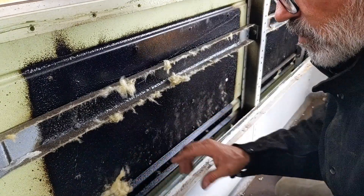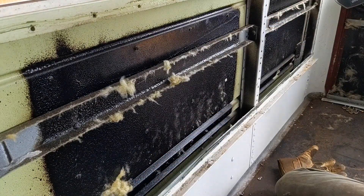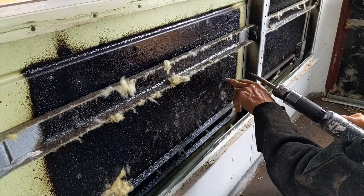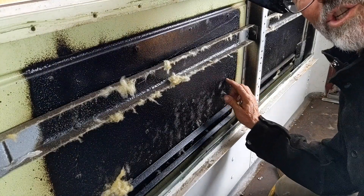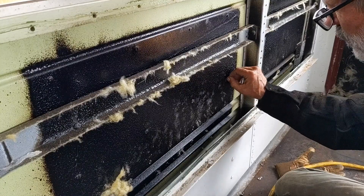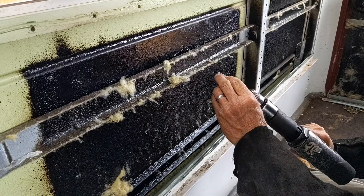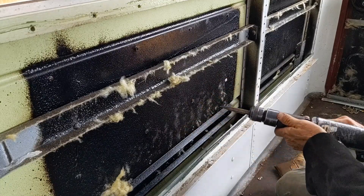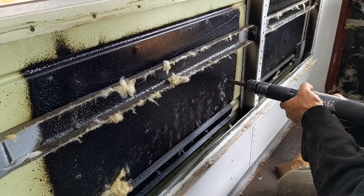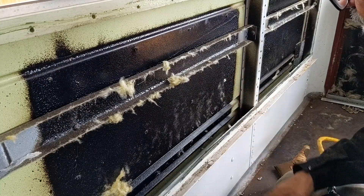Normally I would grind all those off at once and pop them out in a second pass. The hardest part after grinding is finding the rivet head — I can just barely see the contour. I'm using a pointed chisel bit in an air hammer, put it against the rivet head, and pop it out, leaving a nice clean hole.